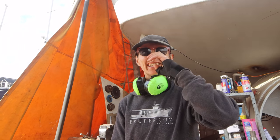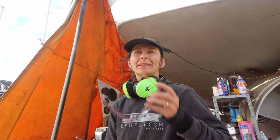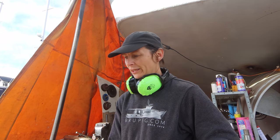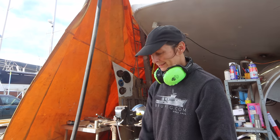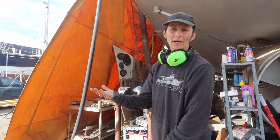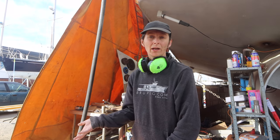This is a shitty ply. What is it? It's like B or C or? No, that's the technical name, shitty ply. C-grade? C and D-grade. It's structural ply, but one side's D, one side's C. Yeah, so structural ply, it's not great. You get knots and they sometimes put putty in holes and things like that. But it's like $50 compared to what we would need A-grade.